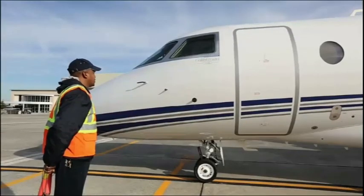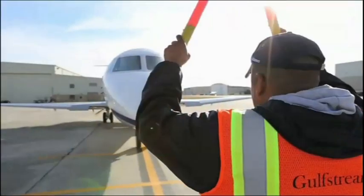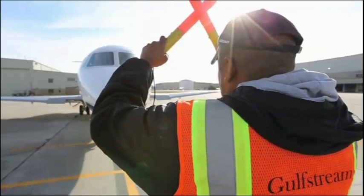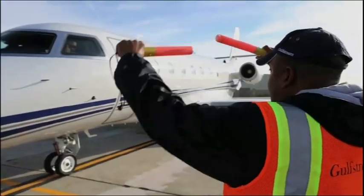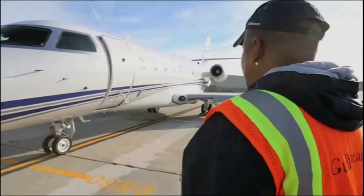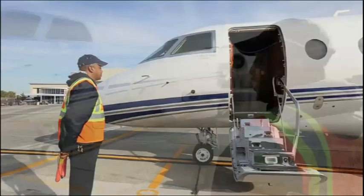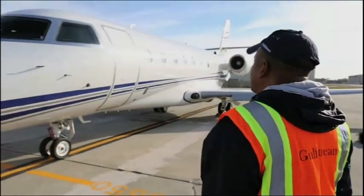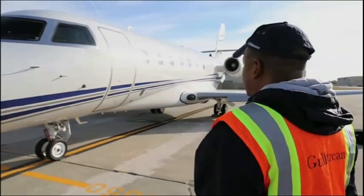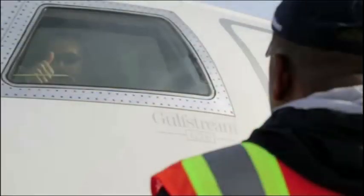Verify door path is clear and aircraft is not pressurized. When approaching an aircraft that has just returned from a flight or that has been pressurized on the ground, allow the flight crew or maintenance crew inside to open the main entrance door. From the inside, the crew will know when the aircraft's differential pressure has equalized with ambient pressure. If it is necessary to open the door from the outside, allow the flight crew or maintenance crew inside to give you the all-clear signal once they have verified the aircraft has depressurized.